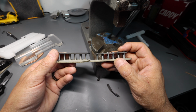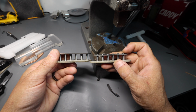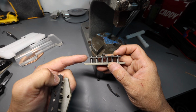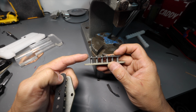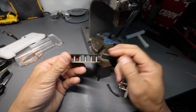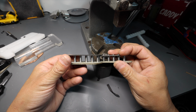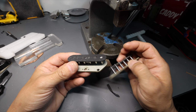It might not seem like a lot of a difference, but coil height, coil dimension is a very big deal. In fact, if you were to use longer or shorter magnets here, or make this distance from here to here shorter or taller, even this Strat pickup would sound different to another Strat pickup. So even this small difference in height will make a big difference in tone, even if we were to use the same exact wind count, same everything else, but just change that height just a little bit.